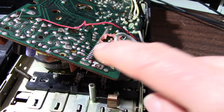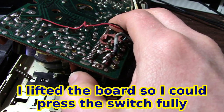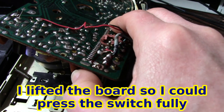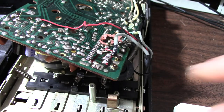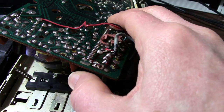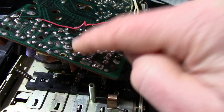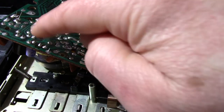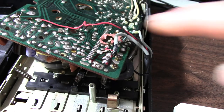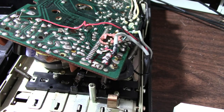As it turns out, it was just the play/record switch was a little crusty. I exercised it a few times by pushing it, and now it plays and records — no static or anything, I didn't even have to spray it. The next thing I did was use Shango 066's audio capacitor check technique, where you put an audio signal through the capacitors right on the board without having to take them out.